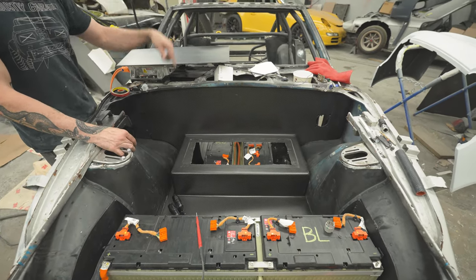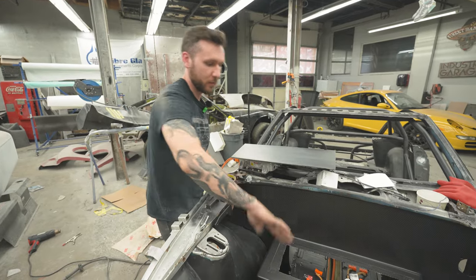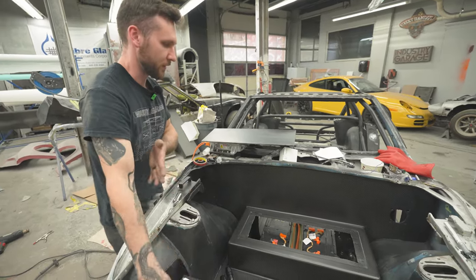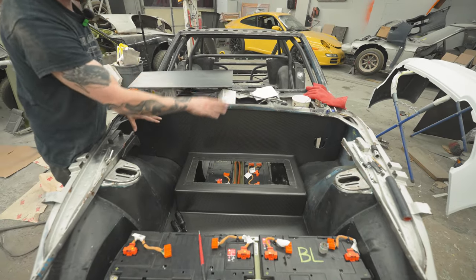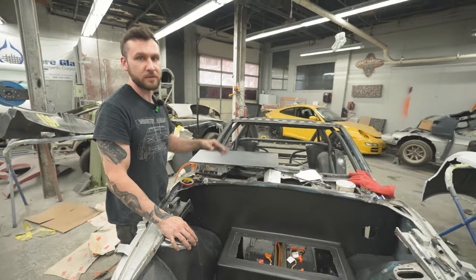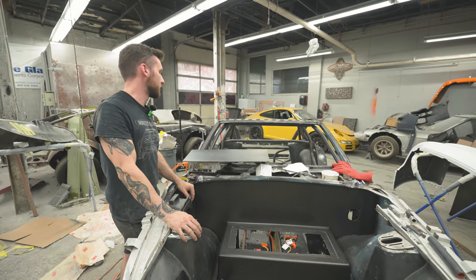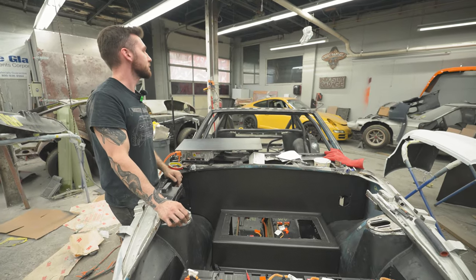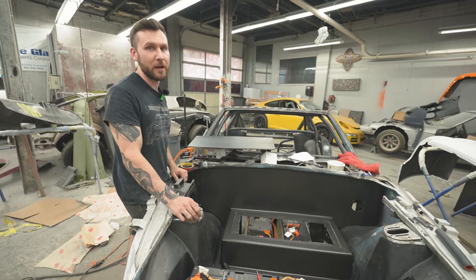Here are the two Vibrant fittings that are going to run hose down below and above, right through here to the two coolant ports of the CCU. One to the coolant port and then we'll have a little reservoir. With the service hole open you can see all the stuff — I can get to the steering column and the batteries if I need to. All the BMS units for the center are going to sit on top of the batteries, and the BMS units for this side are going to sit against the firewall. These batteries will have a nice carbon battery tray cover. You'll actually have a decent amount of space for luggage in here. Other than the CCU and the brake booster, this is all going to be a frunk. The trunk is still usable with more storage space than a stock Z. I'm just hoping we can get it to around the same weight as a stock 280Z — we have vehicle scales now and my wife's 280 over there to compare.